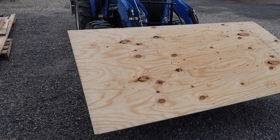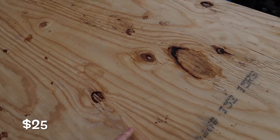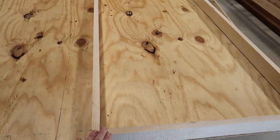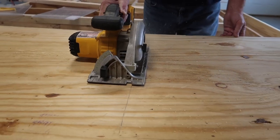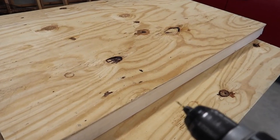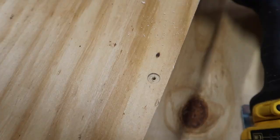We have this piece of board laying around that we're going to use for the lizard enclosure. This piece will go for about $25 to $30 — a little more expensive, but I like it better than OSB because it looks nicer and is more durable. We're going to etch the bottom for our measurement, and we have the bottom cut out. We're going to put it on top of our frame and, as we did with the L brackets, we're going to pre-drill so we don't crack our wood.